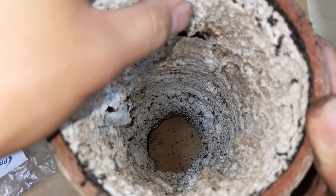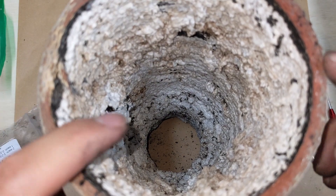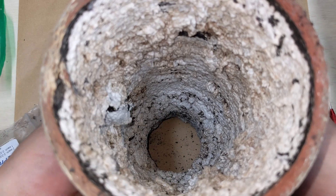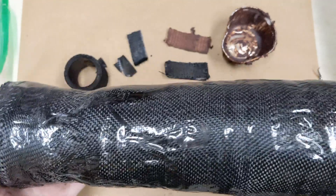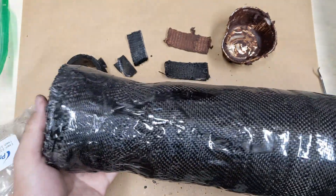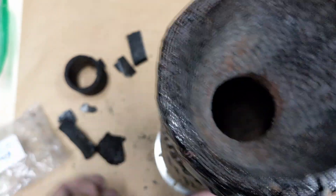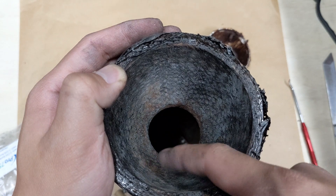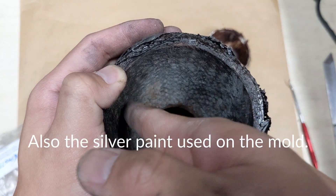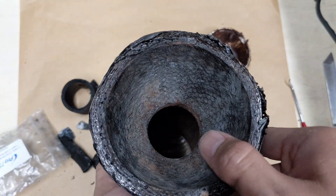White char, black char — all the same, and still pretty tough. Now you can imagine how that affects your chamber performance. For another point of comparison, here's a chamber that I made a while back using silica and phenyl resorcinol. Though it has been fired, it's probably dark just because of how long it's been sitting and curing — there's still some of the reddish color of the resorcinol.